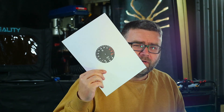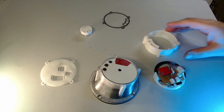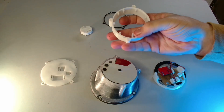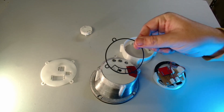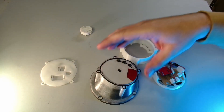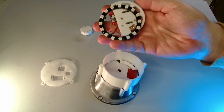I don't think anybody's going to crucify you over printing off your dials and using that — I'm just a bit fussy, I want to make it look like an actual car gauge. So once it's done it just goes in the groove inside the housing, and on the back of that we put this extra housing. You'll notice it's got a couple of little cutouts in there and this is for the LEDs to peek through — or the NeoPixels. It's got a gasket that goes on top, and it's pretty amazing what these laser cutters can do. Imagine trying to cut that out with a scalpel — you'd be going nuts. It fits up there, lines up the holes for the lights, and goes on top.